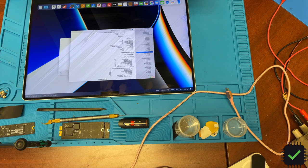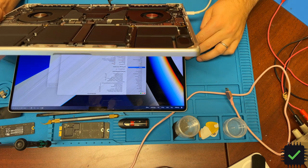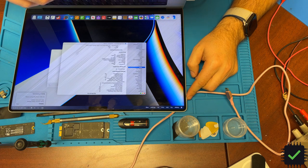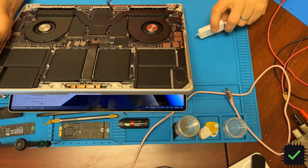What I ended up doing was cleaning up the original chip. I took a closer look at it - it wasn't really a burn mark. When these chips get water underneath, it can look like that, but I didn't see that it was physically burned. I cleaned it up a little bit, re-balled it, put it in, and now we have charging on the USB-C port. USB-C port is charging very well - no issues. It's at 77% already. I checked with my thermal camera - everything's fine.